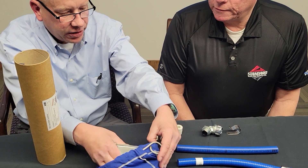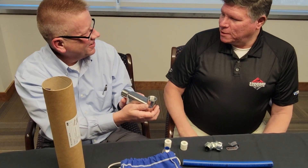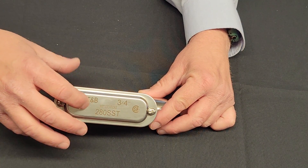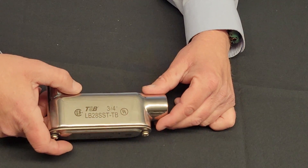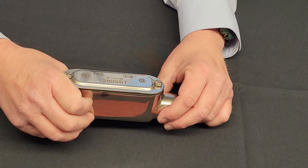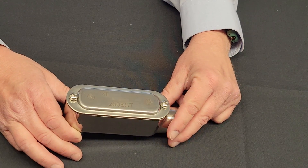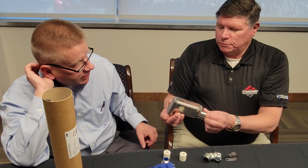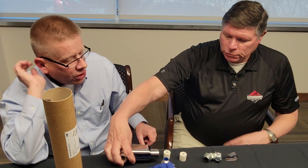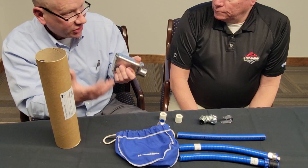And the last thing — we refer to this as an LB conduit body. The big difference in this conduit body versus our previous version and even our competition is that the part number and the UL and CSA markings are laser engraved, laser etched. That's another means of protecting your system from bacterial growth, so gunk doesn't gather in a label on the product. This is a 316 stainless steel conduit body. In corrosive environments you want that type of protection — so the coating on a normal conduit body isn't flaking off into your peas, pizza, cheese, or beer — whatever you're producing.